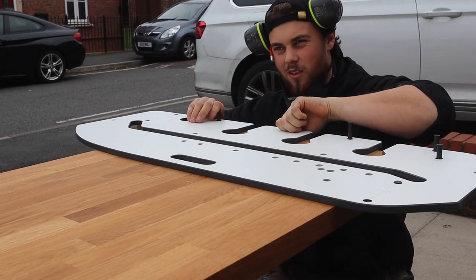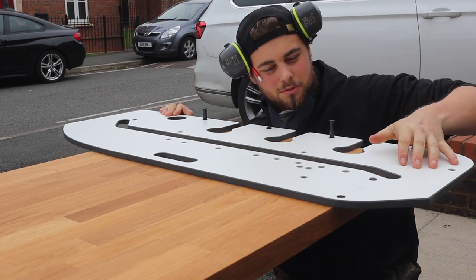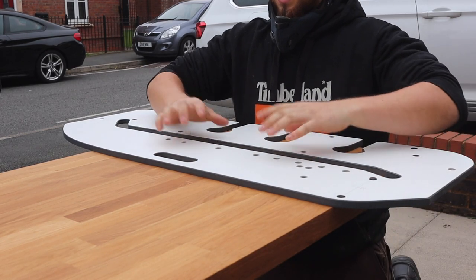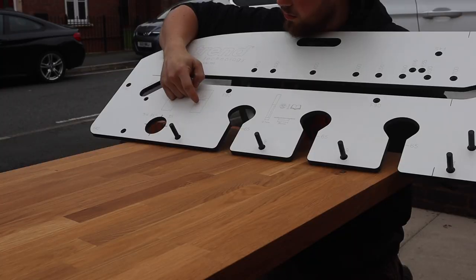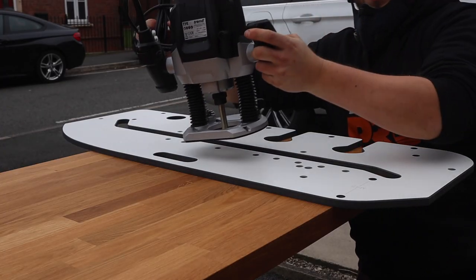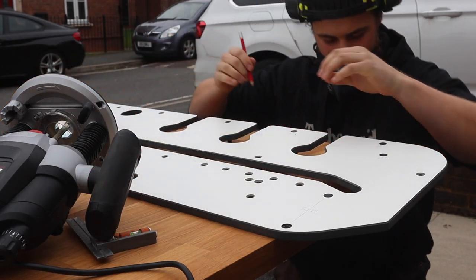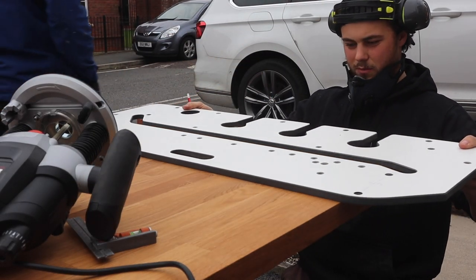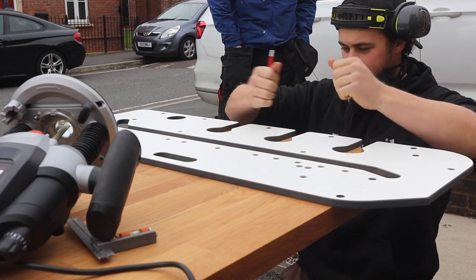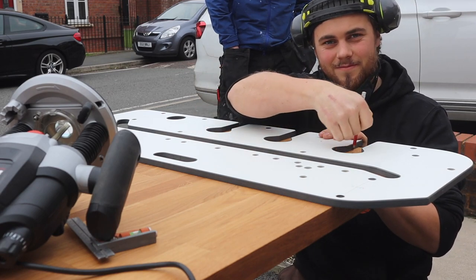It's been a long time since I've done this. I think these pegs are possibly the most important thing ever with power tools — if you lose these, it's not the end of the world. This is technically the female end, and with the diagram on these, this side needs to face down. The easiest thing to do is mark your dog bolts, measure the depth of them, and then mark it on the worktop so you know where you're going. Much easier than messing. So then you can just plunge — I like to do it in three passes. Never do it in one pass because your motor on your router will burn out very quickly.